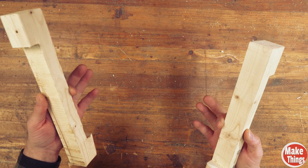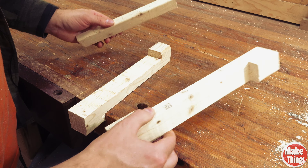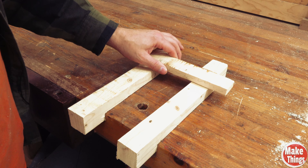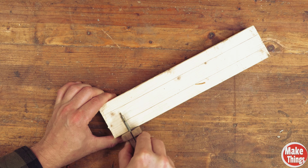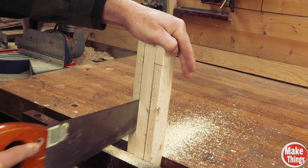Here I've got a 19th century style bench — or side — hook. These types of hooks were generally made in pairs, as they were made to work in tandem with each other. Because they are so narrow, you need a second one to balance your stock and keep it off the surface as you cut. They're very simple to create and can be made with two 2x3s that are 12 inches long.